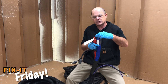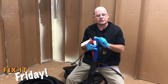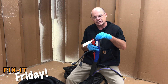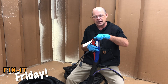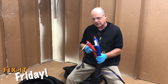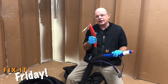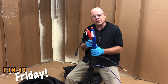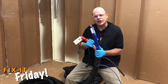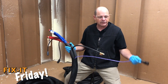They're JIC fittings — number five and six, I believe. You'll notice that the resins are larger fittings than the ISOs are, so it's not impossible but it's not very often that you'd get those confused. You'll notice that the A side — the ISO side, the hardener side — is marked red, and your B side, your resin side, is generally blue. That runs pretty standard amongst the various manufacturers.